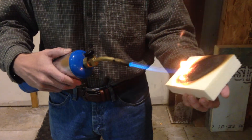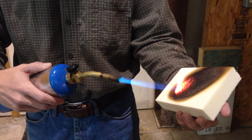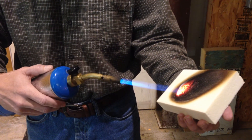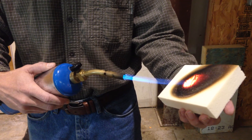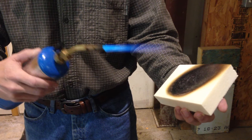Go into some new foam that flashes off. It seals itself off and it maintains structure. Now, if I ever pull the torch away, it doesn't burn. It does not conduct flame — or does not promote flame is the technical term. It will not promote flame.